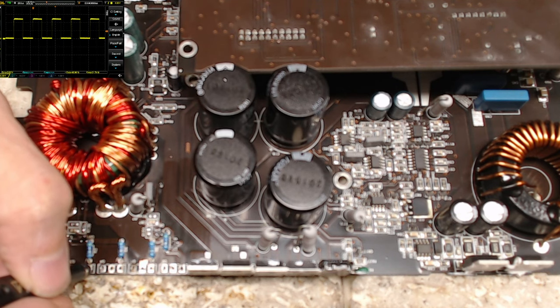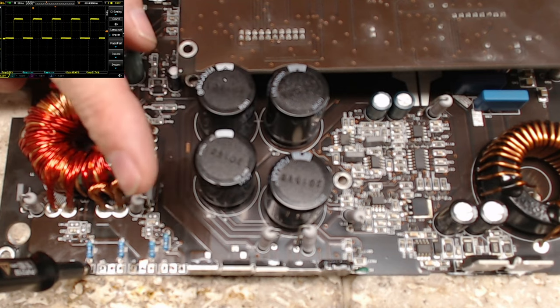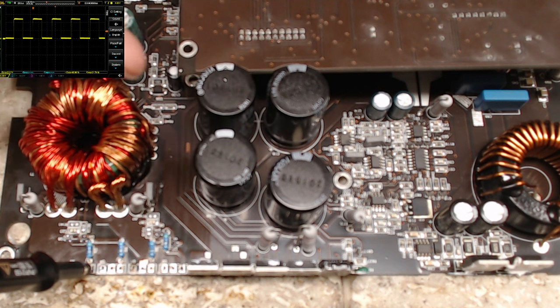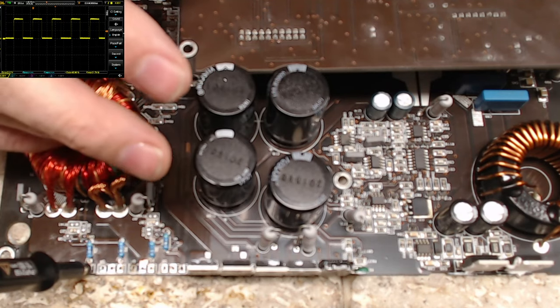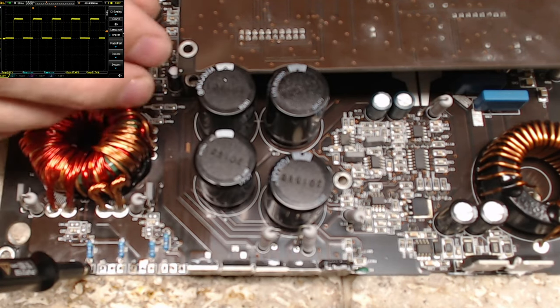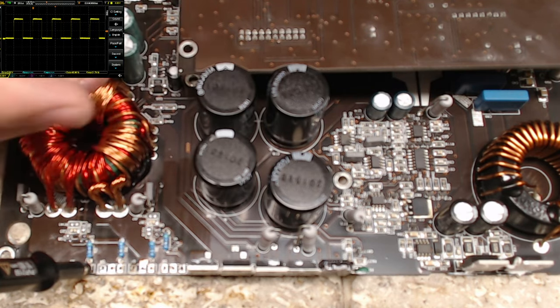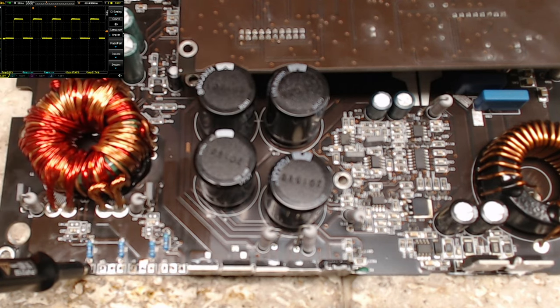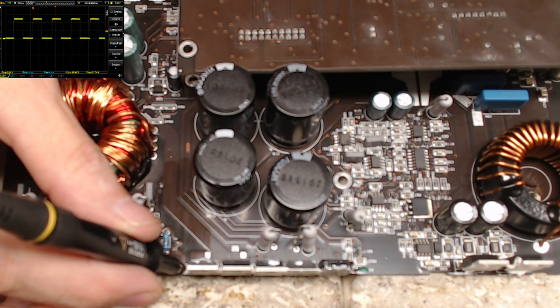And you guys notice something about this particular RD500 amplifier by JL Audio: it does not go into shutdown if there's no rail voltage, because you see the power supply here is maintaining the drive. So this does not have the same processing, I should say, as the other JL amplifiers, where if you start it up and it doesn't see rail, it may turn off. I don't know if I ever paid attention that JL will shut down if it does not see rail voltage.